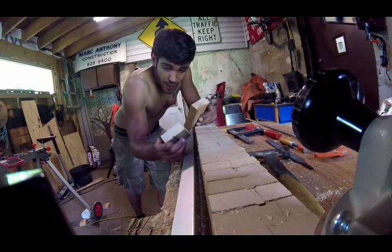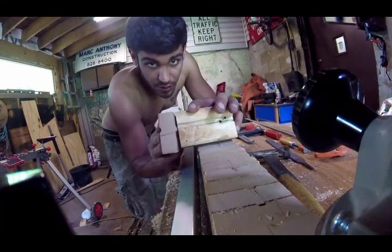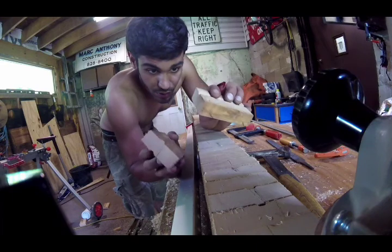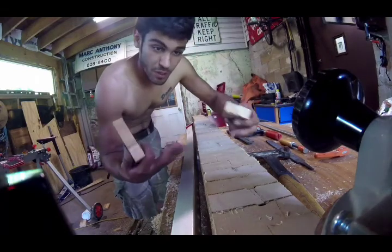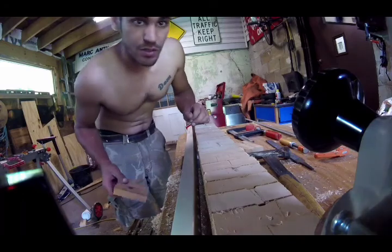Cut for the herringbone pattern, but we only have one problem. The blocks won't butt into each other without a notch in the end of both sides. So that means we've got a lot of notching to do, and we want to do it as efficiently as possible. So I got my router set up, and I got all these blocks clamped in a big long clamp.